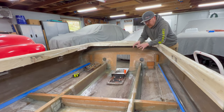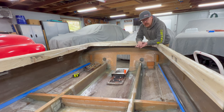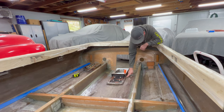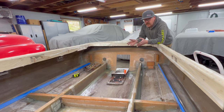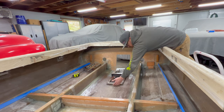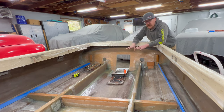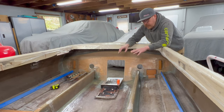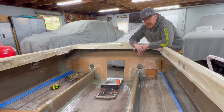Now that I have the intake mocked in, I'm going to take advantage of this and mark the footprint of the intake on the bottom of the boat so I know where it sits. I'm going to add some layers of 1708 and build this up to get it a little bit thicker, to minimize that gap particularly in the front. It'll give me a little extra strength, and also the epoxy putty you set the intake in with is very strong but I don't want to rely on it sealing up such a large gap. Now's the time to do this — I have the opportunity and don't have to undo any other work. Once I get those layers in, I'll have to come back and reset and re-level the intake before I address the shoe and keel underneath the boat.